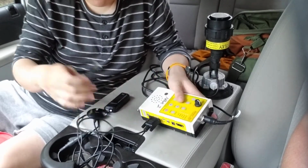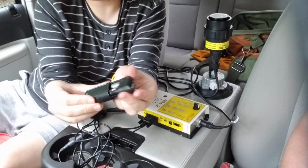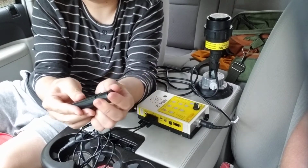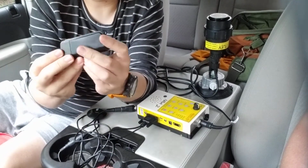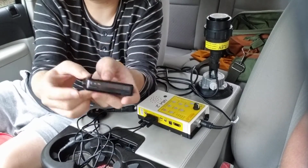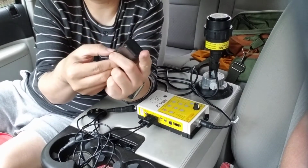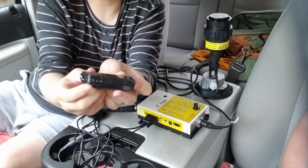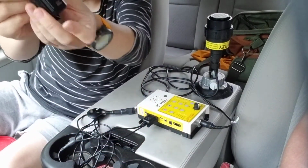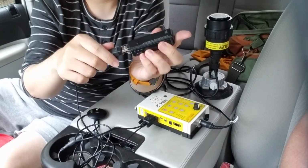So this one is going to connect to the detector and send GPS information into the detector. And then the USB part is for power, and this is the power battery jack. It will have 2 batteries in it, 2 AA, and you put it together. And on the side, actually, you can turn it on and off. It stays in the middle, it's off, and there's a small flashlight. And then you need to push the other way, it says USB. Once it's in USB, actually, you can see there's a red light that is already on. And then you push the USB cable in.